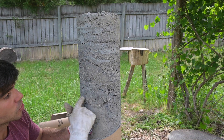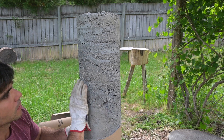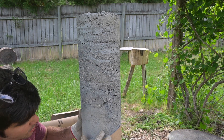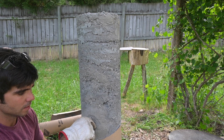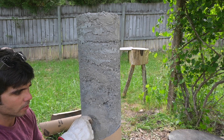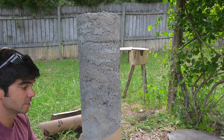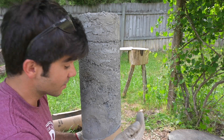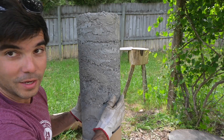One thing that stands out is the stratification — you see large rocks, thin sediment, large rocks, thin material. And something I just noticed is that we have a huge pocket of dry concrete. Look at that, it's just powder. From right here, I think this is a bust. Dry pouring in layers is not gonna fix your situation. But I'm curious — let's cut the rest out. Maybe it looks a little bit different down here. I'm not very hopeful, but we gotta do it.